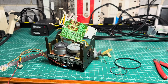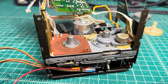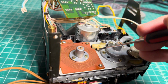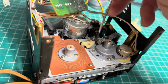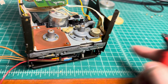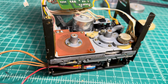See you soon. Okay, I just completed lubrication. So lubricate gear here from the bottom, then rotate it to the other end, lubricate again and rotate a couple times. Lubricate for this lever there. Lubricate for this lever down there. Alright? That's 3 points. And through this hole you may deoxidize this spot and rotate a couple times back and forth to make sure that it will be cleaned up inside. And that's everything you need to do.